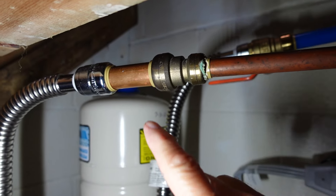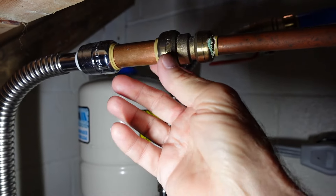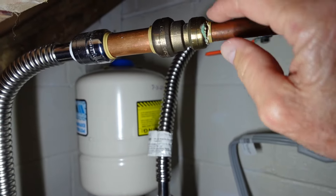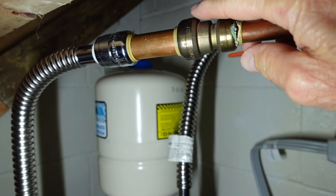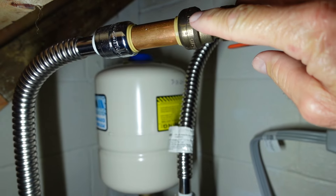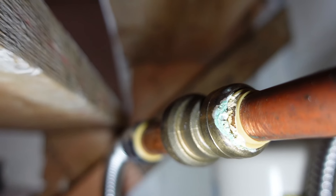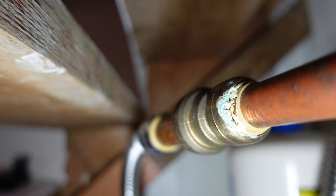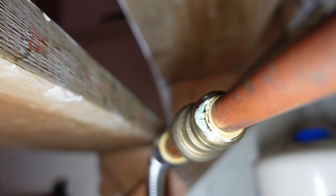You can probably already tell — we're coming from a three-quarter inch, reducing down to half. Like I said, the three-quarter inch is just fine. The half inch is where the corrosion is. It's got the same markings as the other one, even the 05-07 date stamp up there at the top. It is Cash Acme — this is before they were stamping them SharkBite. The depth of that corrosion may be hard to see on camera, but they're just digging in there pretty good.